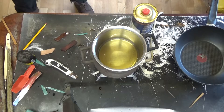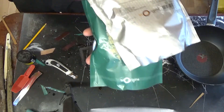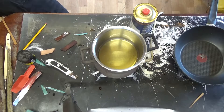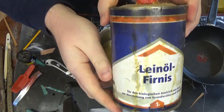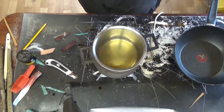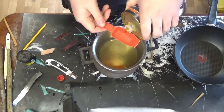Hello, Lars here, small bonus episode. I was buying carnauba wax and beeswax online and read in one of the comments that you can make your own natural wood varnish if you mix five percent beeswax, five percent carnauba wax, with ninety percent linseed oil and heat it up until it's all mixed.